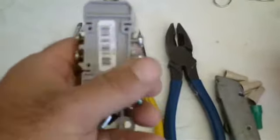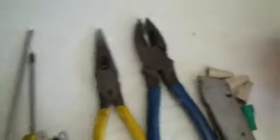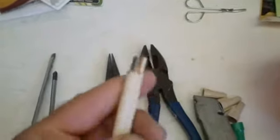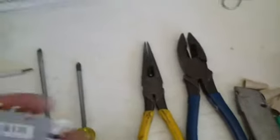They have finally changed the manufacturing and the laws so that you can only push number 14 wire in, which is now, according to the National Electric Code, white shielded. Some of those you could push number 12. I do not, repeat, do not recommend that you do that.